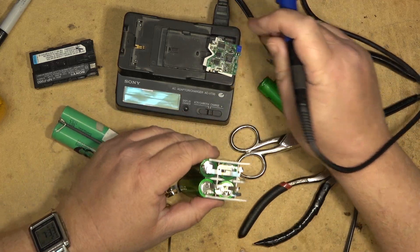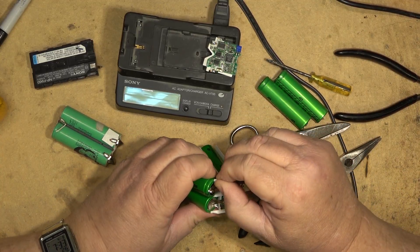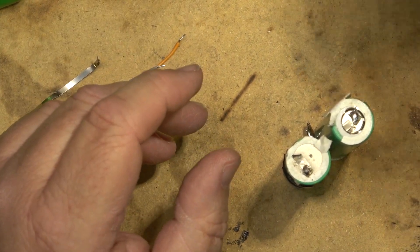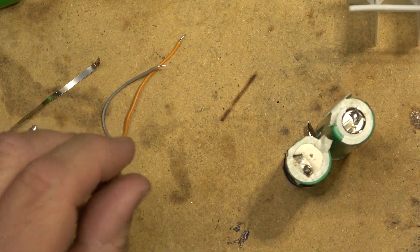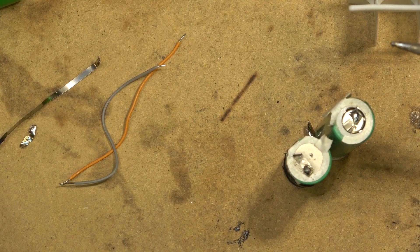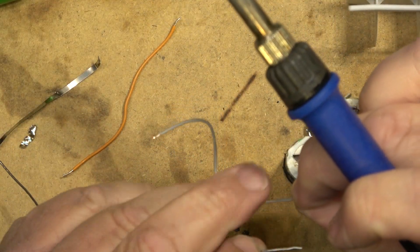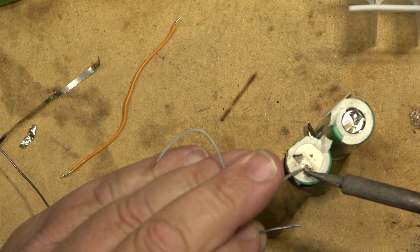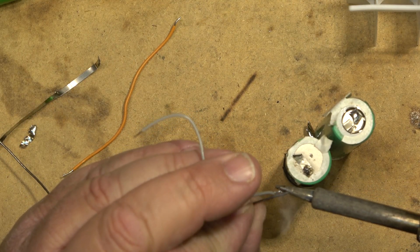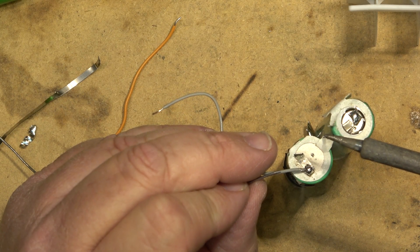There's the little circuit board out of the way. I'm going to mount these cells in the center holder and use extended wires to connect to the circuit board — it's a little bit safer than trying to jam them right up to the front where there's not a lot of space. We're going to solder a couple of wires onto the two cells and to the center tap for cell balancing. There's my negative wire.